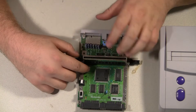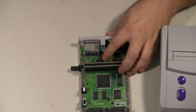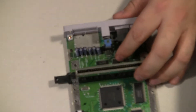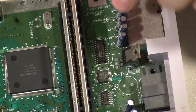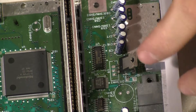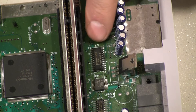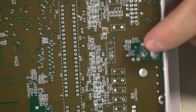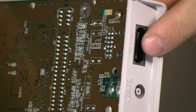This is the motherboard. Back here you have your sRGB chip — very typical for all Super Nintendos. It has the pins for S-video, they're just not going anywhere. So what we're going to do is connect the components to this chip and run wires to the bottom side of the board where the pins for the multi-out connector are.